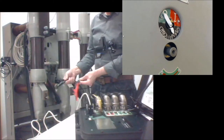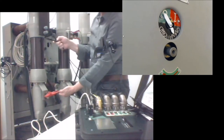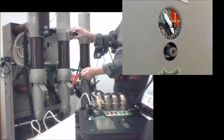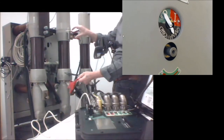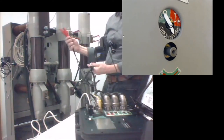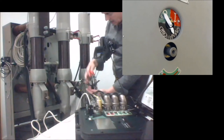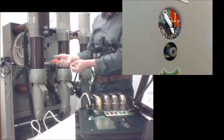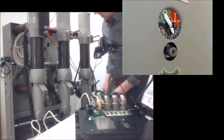So what I'm going to do is to place these pairs, one on each side of the circuit breaker. Now look at this. You see the circuit breaker is already partially connected, and I see that the red connections have been used on the upper plates. So I have to be consistent and place the red connections on the upper plates. I take the R connection, which is for resistance, and place it here. I will show you why I'm placing it here and not here. The other red here, and I go with the blacks and do the same on the lower plate of